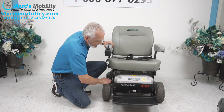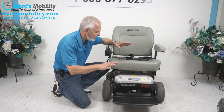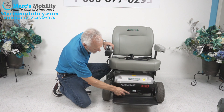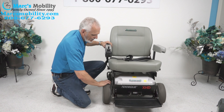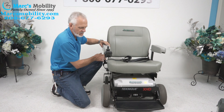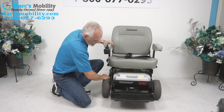You couldn't roll this chair right now because it's in gear, and it probably weighs 275 pounds as it sits there. But if you turn the power off, there's a knob for each motor. If I push this knob down, and this one down, the chair is now in neutral — as you can see. When I push it back in gear, you can see we're back in gear.